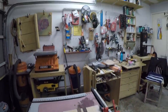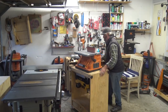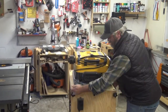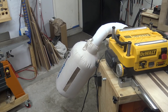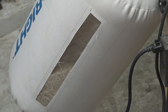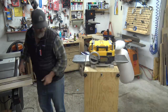I'll do as much glue cleanup as I can when the glue is wet, and then I'm going to pull out the flip top table for the planer and slowly plane down the other side to get it to my desired thickness. It's nice to have two tools on one table — takes up less space in the shop. For dust collection on the planer, I ordered this dust right bag, it was about 30 bucks, it goes down to two microns, and because I had a dust assisted fan in the planer this gets 99% of the dust.